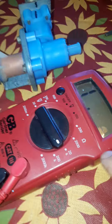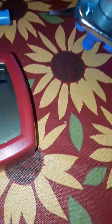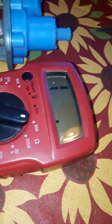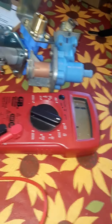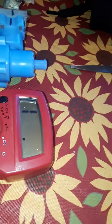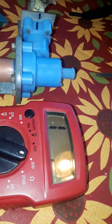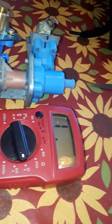My first mistake was I had the ohmmeter on 200. When I went to test the old one, it would register a number and then go blank like that, and that's not right. When I got the new one — same thing — you try to get both hands on there, it's hard to do one-handed, and it flashed. So I bumped it up to 20k.